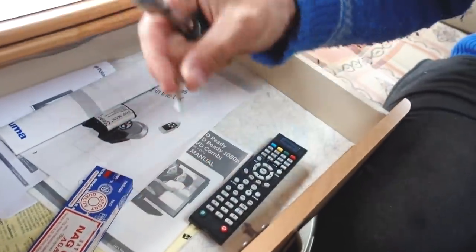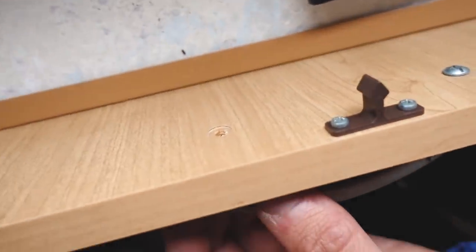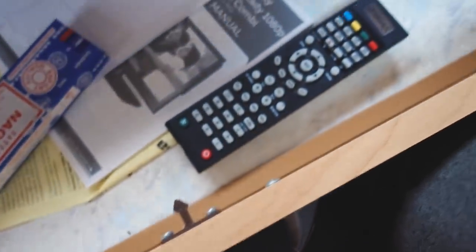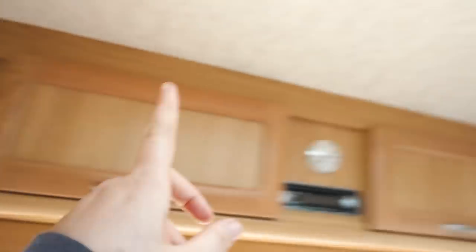Theo wanted to take all the handles off by hand and I think you're regretting it now? I'm regretting it muchly because they're just a lot longer than I thought they were. I thought it'd be really small screws that come out within seconds but that just took me well over a few minutes. The reason I don't want to use a drill is because you can just overpower things and end up shearing or breaking the screws. For something old like this, it's worth taking the time and doing it slowly by hand, especially because we're reusing these screws.